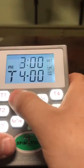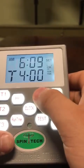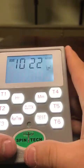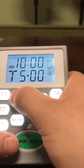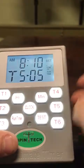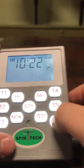So for T4, we're going to have it at 6:10 a.m. — so it's every 2 hours. And then this time we're only going to run it for 10 seconds. Hit the T4 button one more time, and that's going to be set. T5, keep going to 8:10 a.m., and then this time only 5 seconds. We hit the T5 button one more time. That's going to have your time set as well.